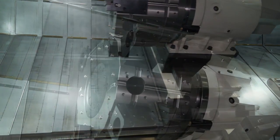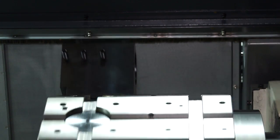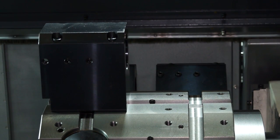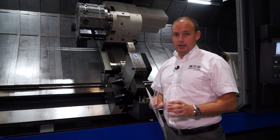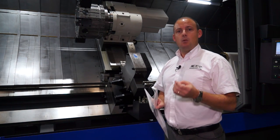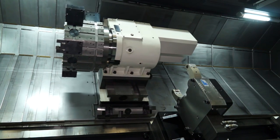The main thing is it's double in width. With it being double in width, you can actually get two tool holders back to back on this machine, which will support your boring bar. In practice, when you're turning or when you're boring, it gives you much more rigidity and much more stability, which in turn gives you far more accuracy and better surface finishes on your part.